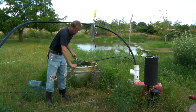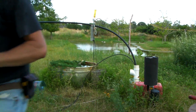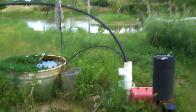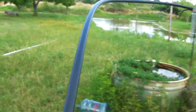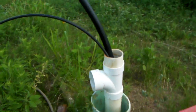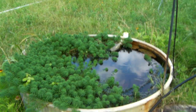I'm going to go ahead and stop the video and there will have to be a part 4, 5 or 6. So I can show you the flow rate. But that was 100 foot of inch and a quarter and this is a 68 foot well and that looks about 30 feet left. So when I cut this, I'll calculate exactly how far down it went. And I'll be giving you an update with the flow rate soon, once I hook this up.